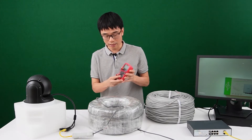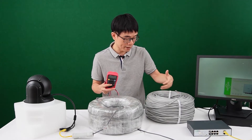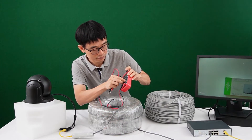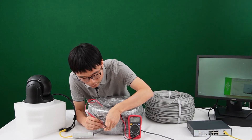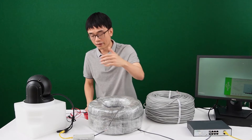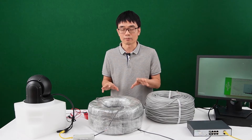This is the expensive one, and it's working. Now I have the power meter and voltage meter to test the positive and negative voltage. We are seeing about 52 volts — that's normal. The PoE switch outputs about 55V, and here we get about 53-54V. That's normal; there's always a voltage drop. As long as the remaining voltage is larger than 36V, the PoE system will work. This is the standard protocol from the PoE standard.